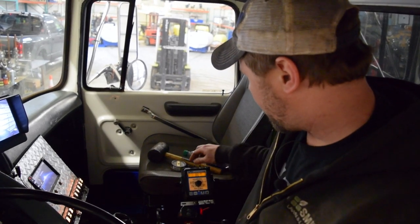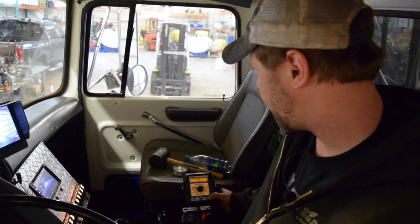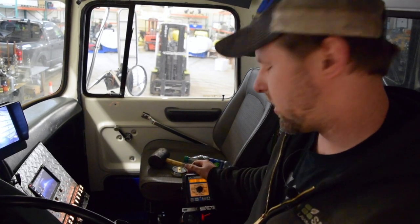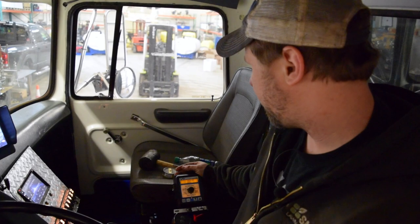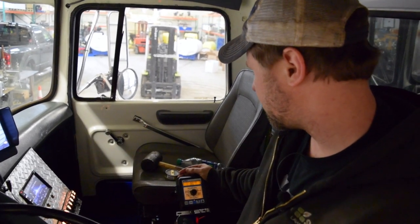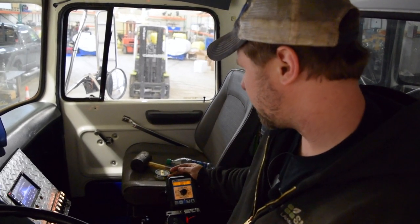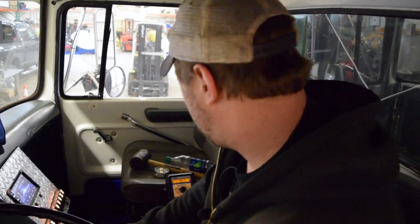We're going to open up our valve, which you can't tell right now because my boom sections are actually off and the truck is off. We're going to open our servo up wide open, and then we're going to open up our three boom sections. What that's going to do is obviously flush that water that we have through the electronics and out the boom. It's a good idea to clean out the boom too for sitting, just so that you don't have any issues coming into the fall when you want to use it again. So we're going to do that here, fire up the truck.